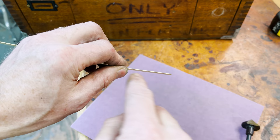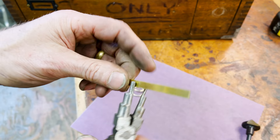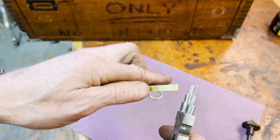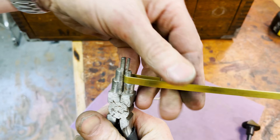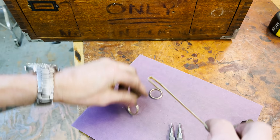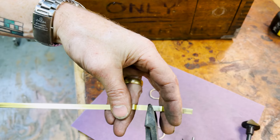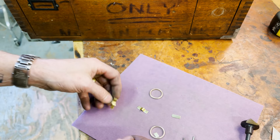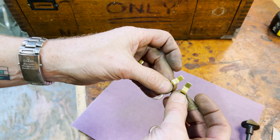Let's make the little brass holders that hold these on my new drawers. For this operation I've got some K&S brass and I'm simply going to bend it with a loop and then two holes on either side. I'm going to do the loop first using these jeweler's pliers. I think I'm going to use this ring — it goes like this. Yeah, I like that. Okay, they're not perfect, but they'll do just great. Now I want to trim and fix these and gussy them up a little bit — a little bit of belt sander and then drill a couple of holes. I'm going to center punch them.